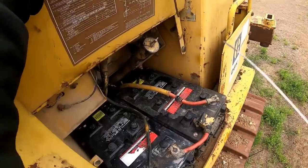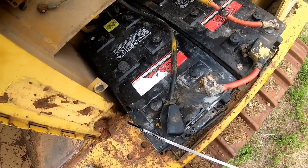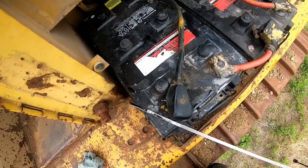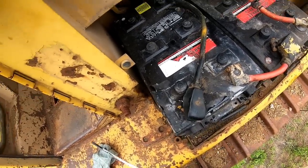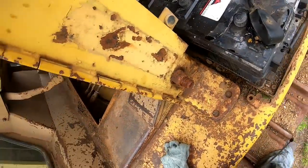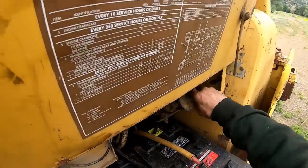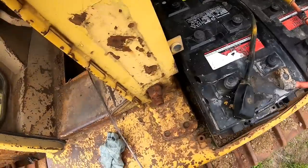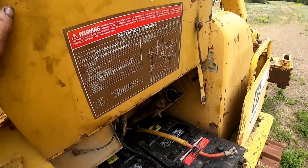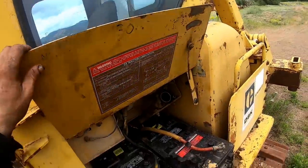Maybe they were in here on the power shifts for the older serial numbers, but I know on the 77V, they're in the battery box. So it says 2 gallons add if you're at the line, and we're, shoot, it's probably 5 gallons low. These guys, man, well, maybe it leaked out. I can't cuss them too much. Let me dump that five gallon bucket of 30 weight in here, and we'll give her a try again.